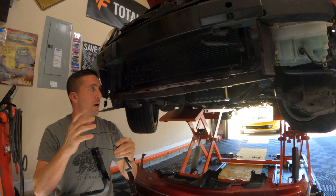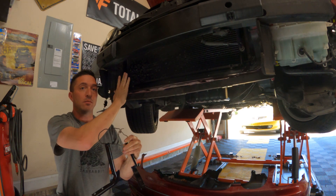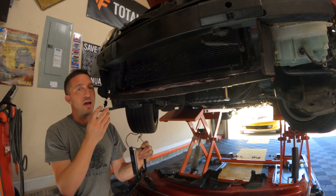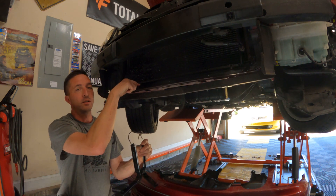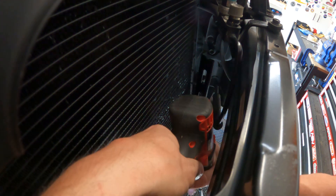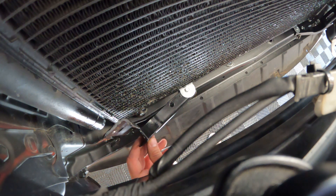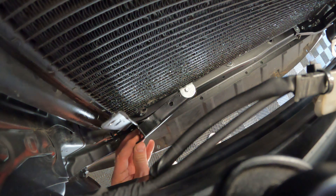The next step is to get these brackets fitted up in here. The bracket on one side I'm going to leave loose so I can move it out of the way and fish the heat exchanger up — that's the only way to get that size heat exchanger to fit. Then I'll tighten down the screws using a real skinny wrench going underneath the heat exchanger. And yes, it's supposed to be at an angle like this. I ran that one in very loose on purpose, because I need to push it over to fit the heat exchanger in and then move it back.